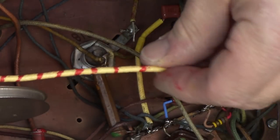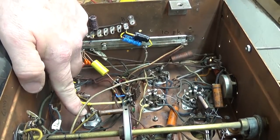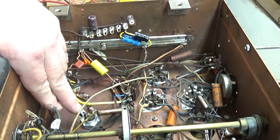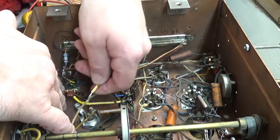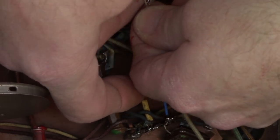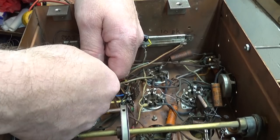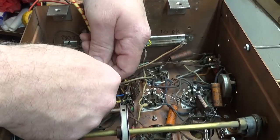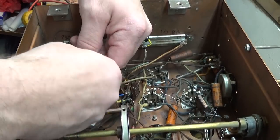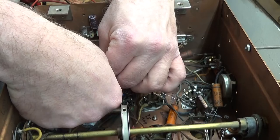The reason I have to extend this wire is that I moved capacitor C18 up to here on the terminal strip. I'm just trying to keep it neat, and I don't want to remove that capacitor. I like to preserve those in place — yes, I replace them, I abandon them. I don't pull them out and restuff them because, in my view, as I've said many times before, that destroys whatever history that component being intact might have provided someone. That is the main reason — it's not because I'm lazy; it's because I don't like destroying that component. Someday, somebody might be curious and want to know how that thing is put together. It makes no difference electrically whether I restuff it or I just relocate it, so I think that's the right way to go.